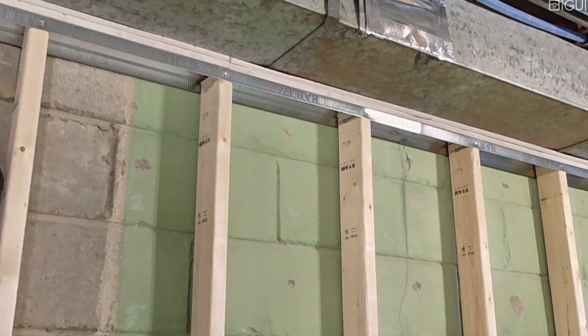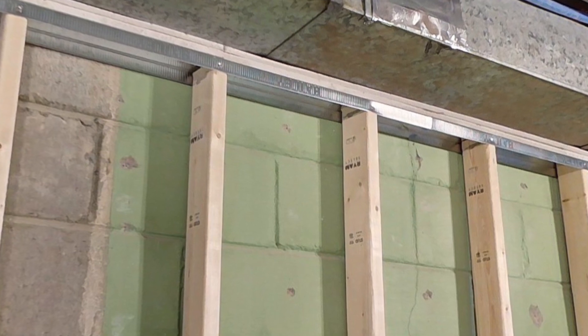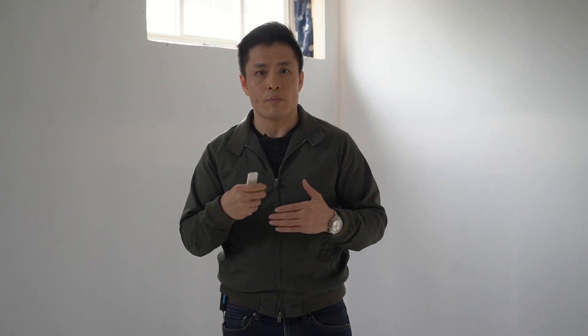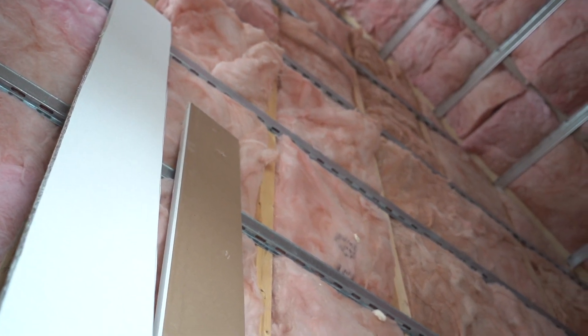Well, a lot of contractors will cut out a strip of fire-rated drywall and place that above the top plate of a wall, so the fire-rated drywall can butt up right against it. You will also need a layer to account for metal resilient channels typically, and it needs to be done for both the interior and the exterior framed walls.